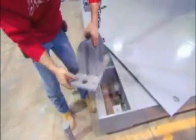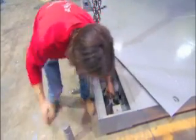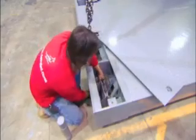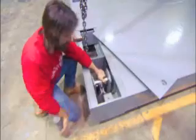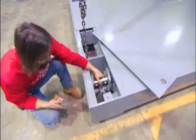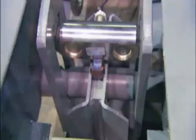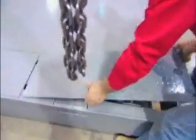The weighbridge, right side up now, contains 8 load cells at different locations. The first step is to install each load cell stand into its respective position. They insert a link on each side of the stand. They position the load cell at the top of the links and the bulkhead pin at the bottom. Then they close up the location with an access plate.